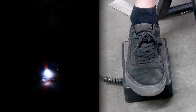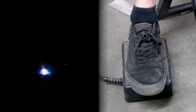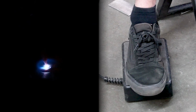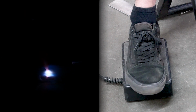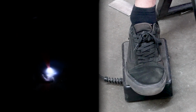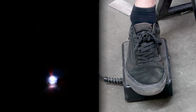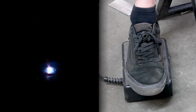Now I don't pause when I'm doing this, I just kind of roll with it. All I really care is that I concentrate on where the edge of that weld pool needs to be. And it's little tiny movements. I have more than enough amperage on the machine, but obviously I don't want all 220 amps that it delivers. I just want enough. So I have it set to about 75 amps, I think, right now. I'm running on the HTP TIG 221 just because that's a very common machine we use here in the shop during training.